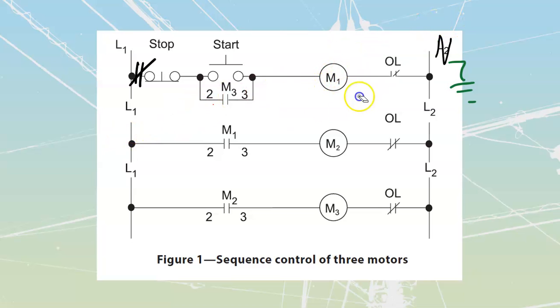So single phase, 120 volts. If you get into motor control, make sure you move it there. 120/208, if you have a 120 volt control circuit, make sure you move the overload over there as well. 347, any of the 277, 480, anything like that. If it is conductively taken, so directly wired onto a system that has a neutral, you have to move the overloads to the front.